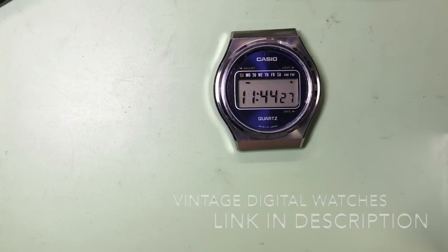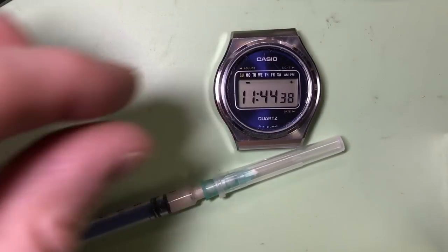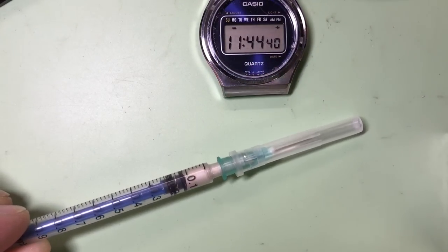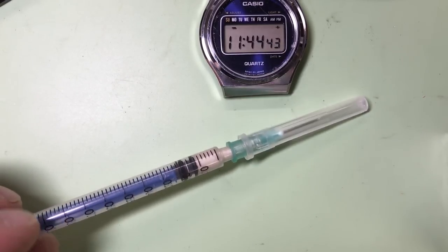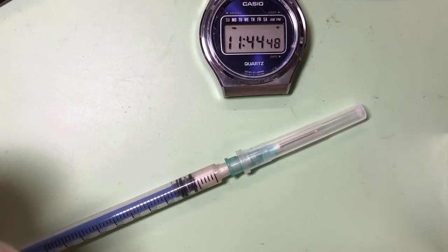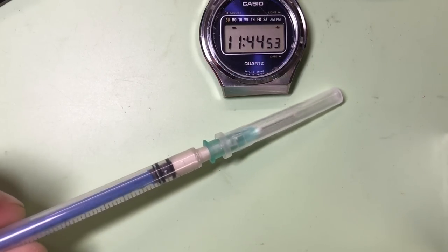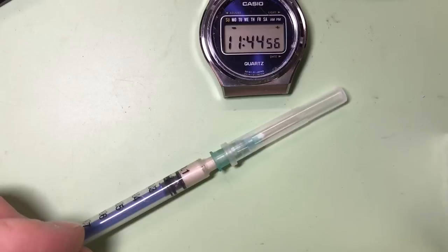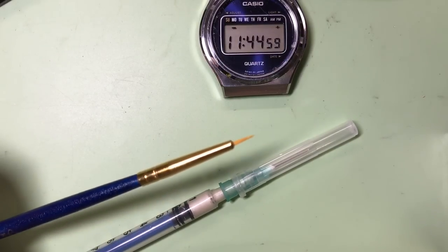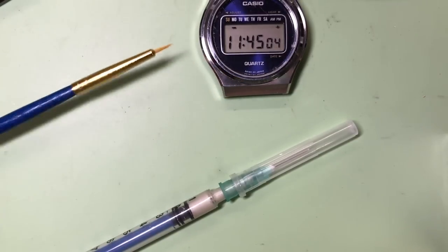what to do now. And what it is, you've got to try and join the contacts back up on a board by using basically this. It comes in different forms, and this is conductive paint, conductive silver paint. He uses on his channel a very liquid type substance. I'd already pre-bought this, and this is a lot thicker, and I use that along with a very fine paintbrush and my microscope, of course.